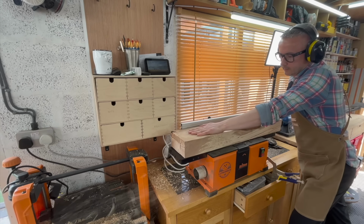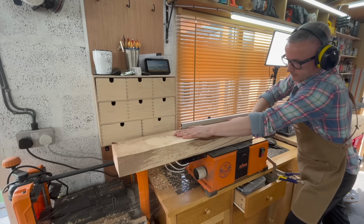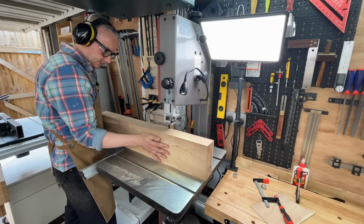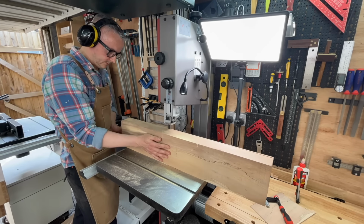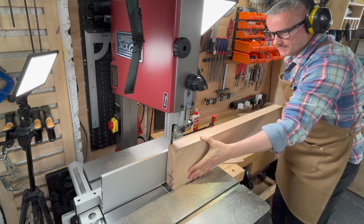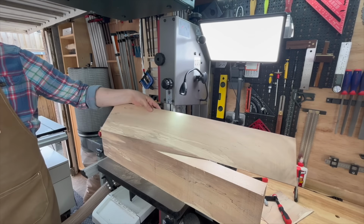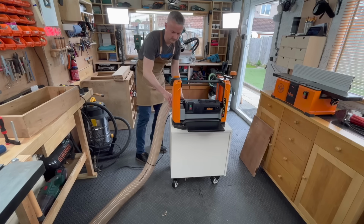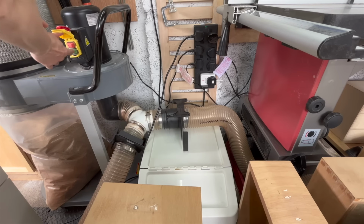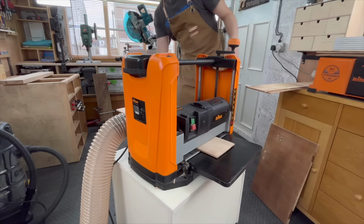So this is where things went wrong. That's all the wood that I had to work with, and I didn't know how dry it was, and I didn't have a moisture content meter, so I kind of took a risk, and I knew there was a high chance of having all sorts of problems, but I did it anyway. So I cut it into semi-thin pieces to use it kind of like veneer, but very thick. And as expected, they warped quite a lot as soon as I finished cutting them, but I kind of knew that would happen. So I glued them onto a piece of plywood and it just didn't work.